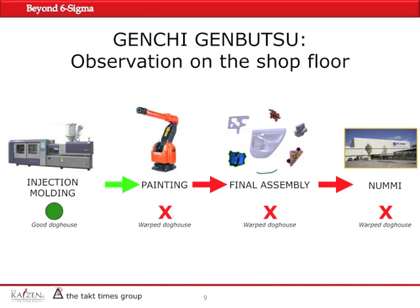The injection molding parts were good — the dog houses were still undeformed. The parts were warped when we went to the paint line. They still warped going into final assembly, and as a result the customer received the warped dog houses, which resulted in difficulty for their team members assembling the door panels onto the sheet metal. By walking on the floor, we were able to identify that the area of concern should not be injection molding. We didn't know exactly where in the process we were causing the problem, but we knew that the paint line was the origination of the deformation of the dog houses.